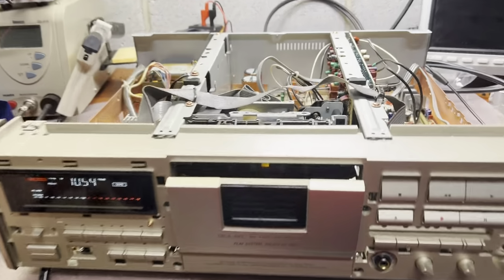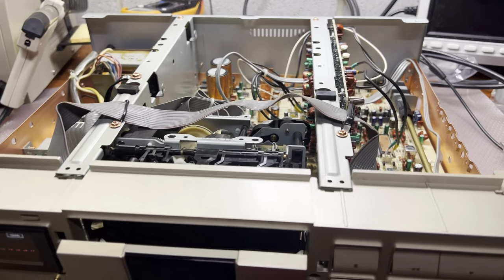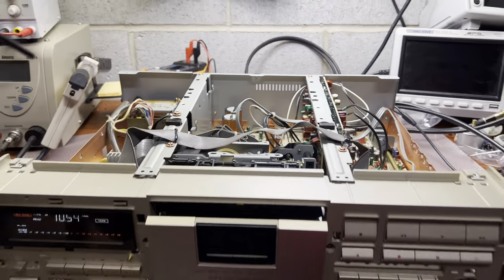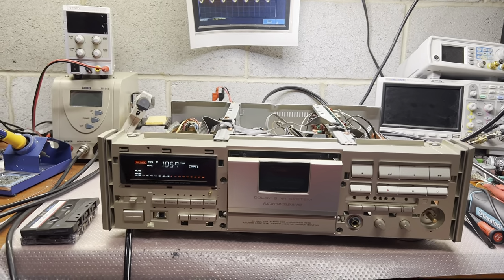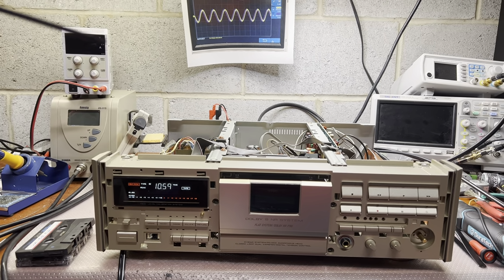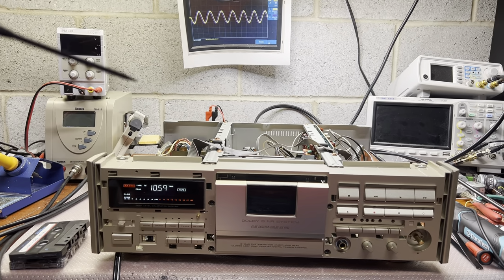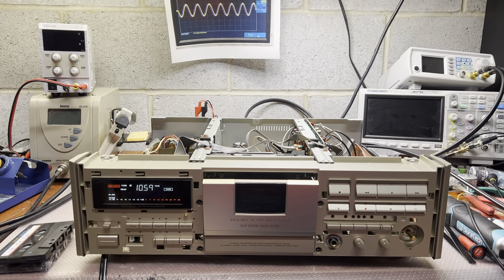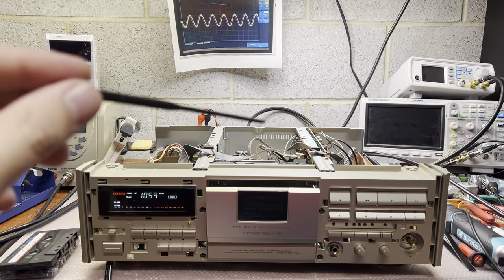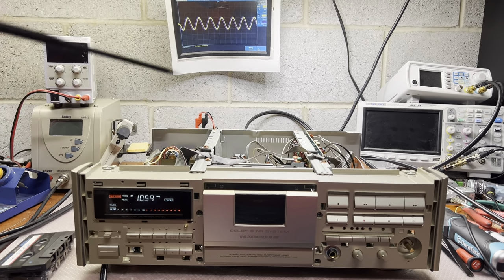And comparing to CT42, I had to make even levels without BLE, and then it perfectly works with BLE. So this deck is making me puzzled. It was minus 2 decibel levels on most of them. The only way to compensate was to increase record levels by plus 2 decibel. Right now I'm quite not sure this deck performs really linear, like it has exactly the same level after calibration as we were setting up without calibration.